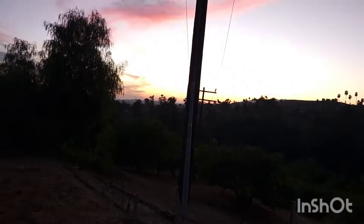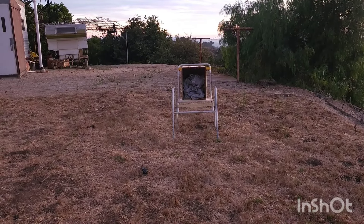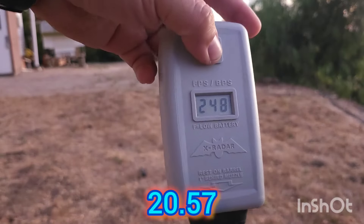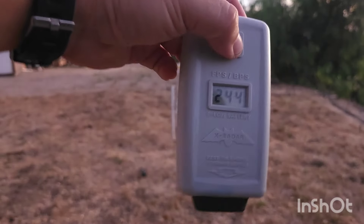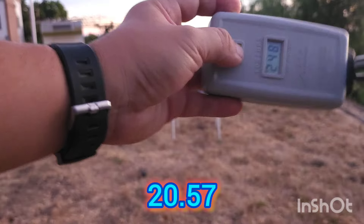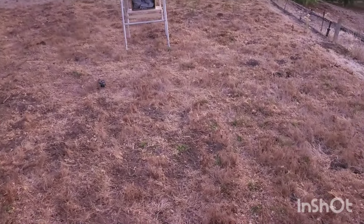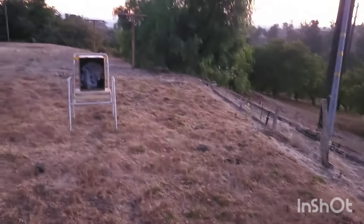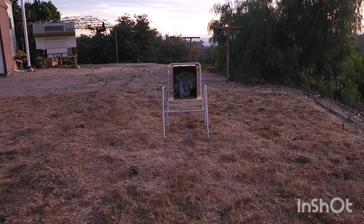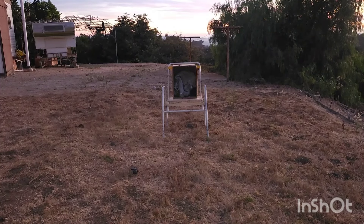Last adjustment for today - running out of daylight. I turned it up one turn. Reading: 248, then 244. Looking at my reference sheet, that's about 18 or 19 joules - still too low. I degassed it and turned it up one turn again. I'm trying to get around 340-350 fps with these 7.2 gram aluminum balls.